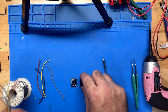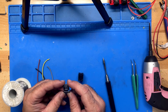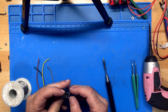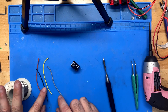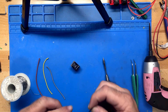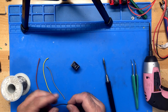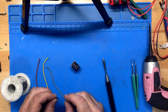I'll now solder together a second one so you'll see the process. The breakout board and the connectors are available as a kit through a variety of places — I bought mine through Amazon. I'm using 22-gauge stranded wire; I like the silicone. It needs to be stranded so that it's flexible when installed in the unit, so you can mount the connectors and work things around. If it's solid core wire, the flexing will eventually crack it, and any vibration in the system will actually break the wire eventually.